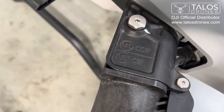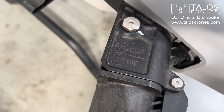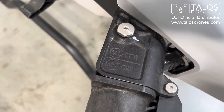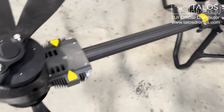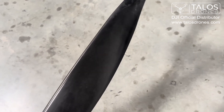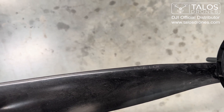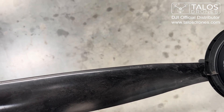And if we look at M5, it will tell us we need a CW and since it's under the line it will be a lower CW. So if we go back to our propeller here and take a look at it — there it is — an LCW or lower clockwise propeller.